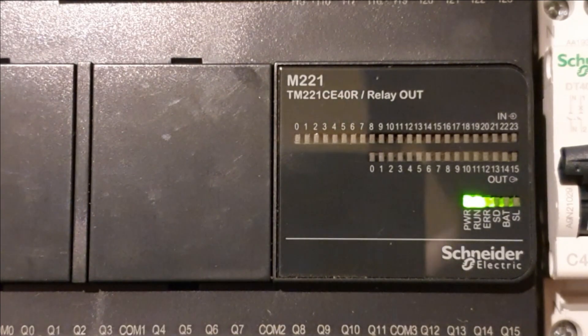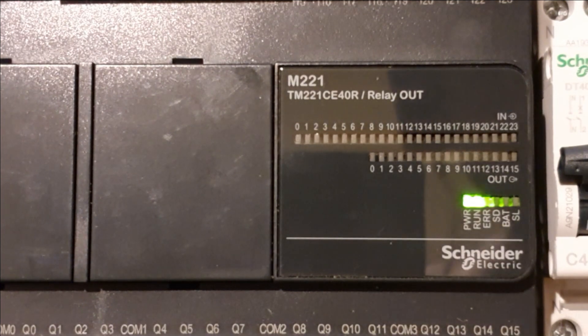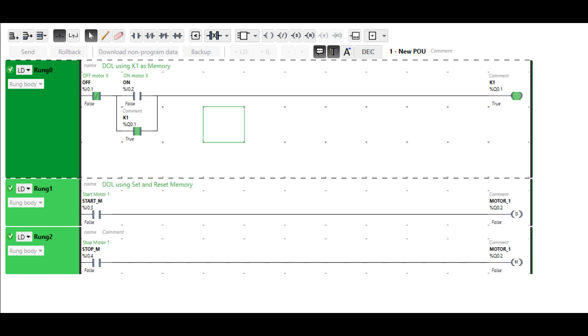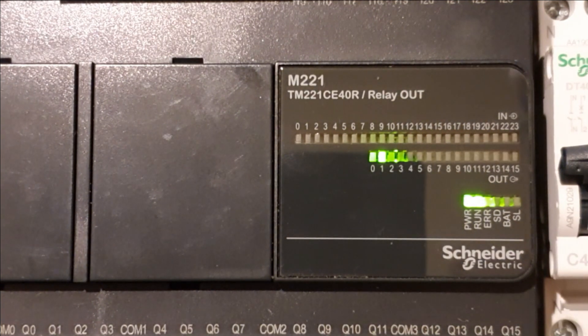Now when I press ON, as you can see it will be input 0.2 which activates here — input 2 is ON. The fact that input 0.2 is ON and you have the normally closed contact on input 0.1 means Q0.1 will be active and will remain ON until I press OFF. When I press OFF, the self-latching relay will be released as the supply to the coil is broken, and Q0.1 will switch OFF.